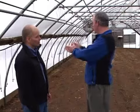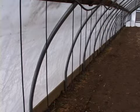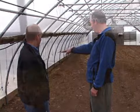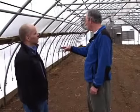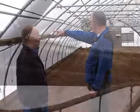The structure uses galvanized pipes about two inches in diameter, driven about three feet into the ground. Attached to them in this particular house is not even pressure-treated wood — it's rough board hemlock grown in Vermont. Native hemlock is very rot-resistant, and up about five feet there is a shoulder board which is pressure treated, as the hemlock has since rotted.